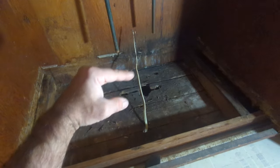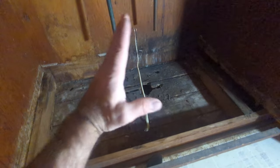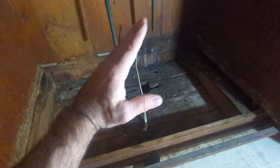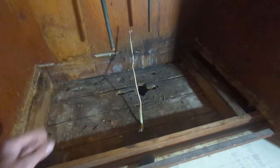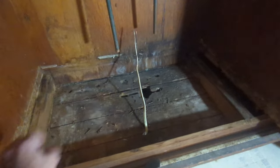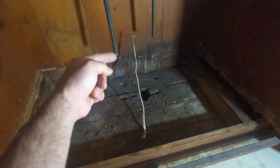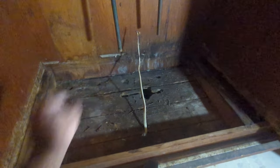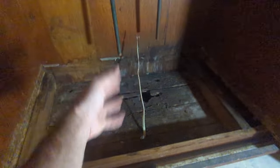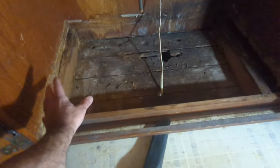It doesn't do this perfectly, but this is the idea, that it can sit in that angled run, that 45 degree angle. As it rips down there, it can seal and draw a vacuum that sucks the water out of the trap itself. So either within the trap's geometry or downstream where that goes at an angle, it's going to pull the water out of that trap and then stinky sinky. And really, that's explosive methane gas that you don't want in the house. And it's a big, big no-no.